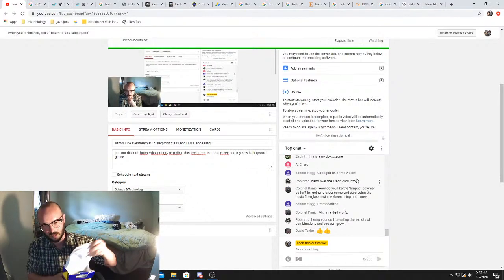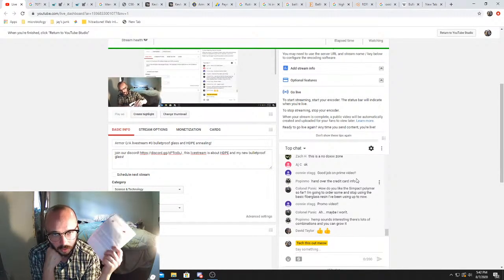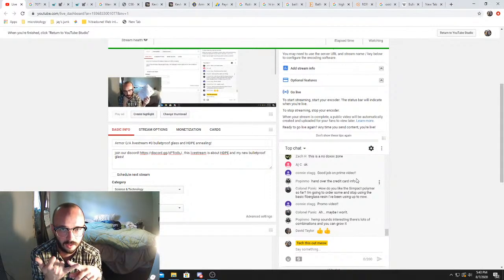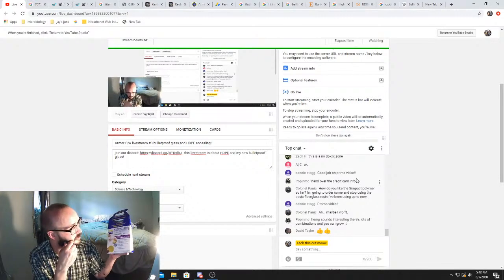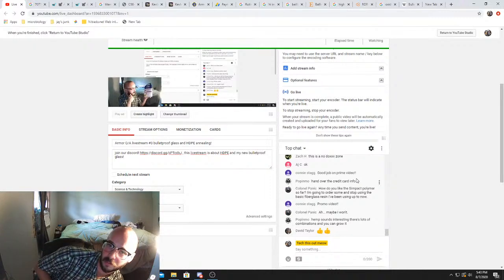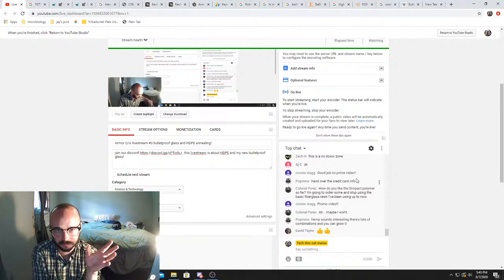This stuff has some of what you're talking about. I'm currently working on how to properly fabricate it. You would have to go in smaller layers. You could not do it all at once. You would have to do like 5 layers, 5 layers, 5 layers, however thick you ended up wanting it. However, the material properties of this stuff here, this 85 Shore A, is unbelievable for a polyurethane. I haven't found one that has the same material properties, to be honest. It might be the most energy absorbent resin I've tried to work with, in a way. It's so good, so yeah, I highly recommend it.